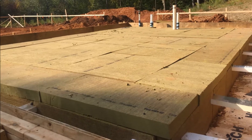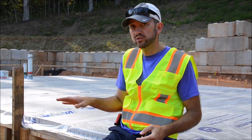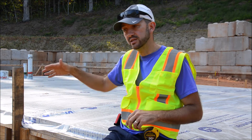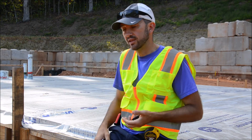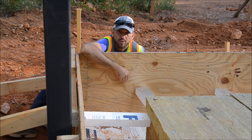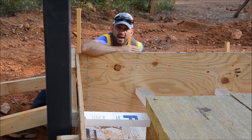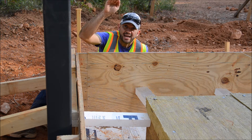We then transition to two inches. The reason we're beefing up the exterior at the edge of the slab is because most of the heat loss in a concrete slab happens at that exterior edge, mostly in the horizontal direction, because the coldest temperature is just outside the edge of the slab. In addition to that interior insulation, once we remove the form board around the edge of the slab, we'll run six inches of rock wool insulation on the outside.